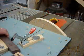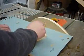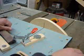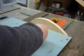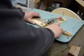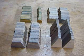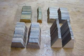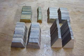We're ready to start cutting some walnut. After about 10 minutes worth of cutting, we've got all our pieces ready to go. The cut time really isn't that long — of course it's the setup time, which is pretty indicative of most woodworking projects. It always takes longer to set something up than to actually do the cutting. So with a few adjustments to both the toggle as well as the stop block, we've got everything ready to go and we're going to move on to the next step.